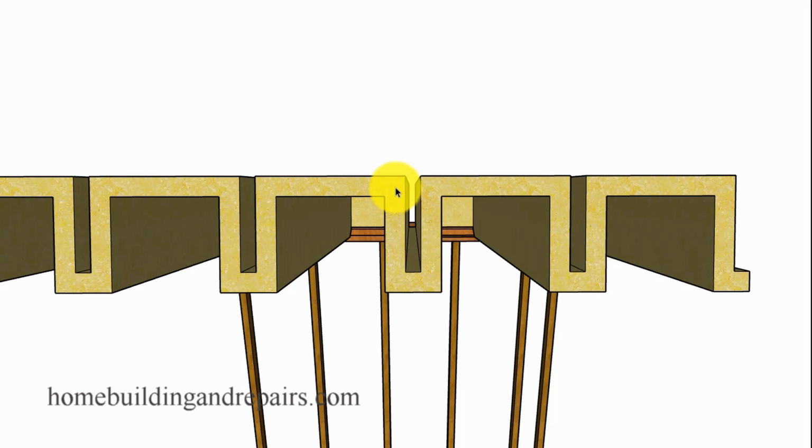So if the foam allows water to flow through it, then this would solve the problem of trapping water in here, but could also create another problem from condensation. If you lived in an area with a lot of humidity, a lot of moisture in the air, now you've got the problem of moisture getting sucked through the foam or sucked into the foam, and then having moisture on the wood, surrounded by the wood for a long time. This would kind of act like a sponge if the foam allowed moisture to flow through it or absorb into it. And if it didn't, and moisture couldn't absorb through it, any water that somehow got into this area, into this cavity, could remain there for a long period of time. And under the right circumstances, accelerate the decomposition process, then that could be a problem, of course.